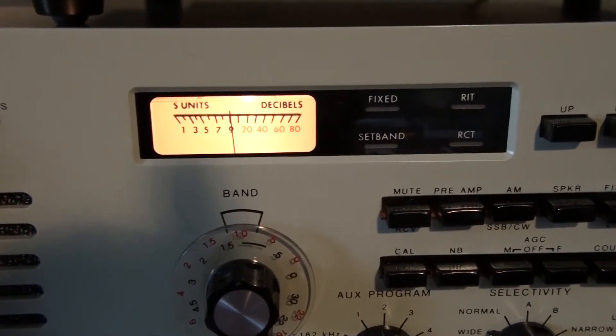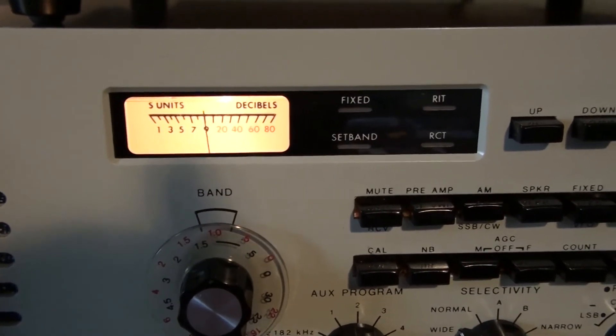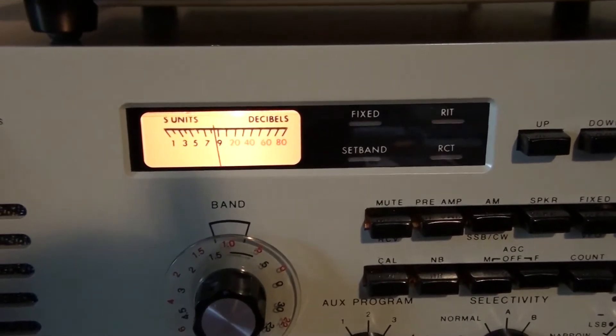Back to fast — jumps all over the place. And when you're on frequency with weak signals, you just hear a chatter — you basically can't use fast AGC at all. In medium I did notice there were some spikes where we are right here. When I put it in slow, most of that disappears, so there's just a little bit in slow — a couple of pops, a little bit more in medium, and fast AGC is all over the place.